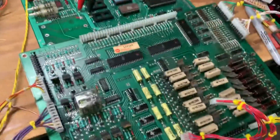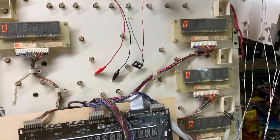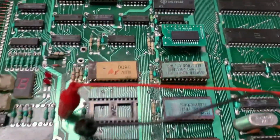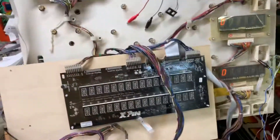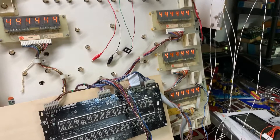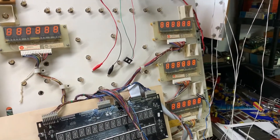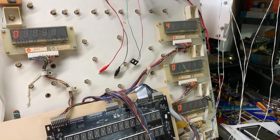I've already got the game on — let me reboot it. I've got an installed NVRAM. This is not his MPU, but this is another MPU that's in there. The Lamp Matrix is functioning and the only coil that's on is the coin lockout coil. The displays are working right now and sound would be playing — again, that comes from the MPU.